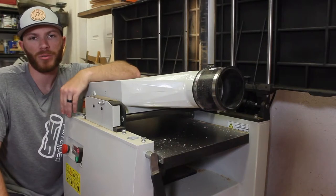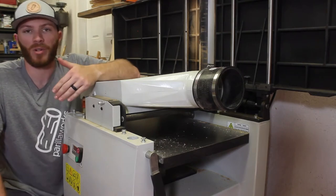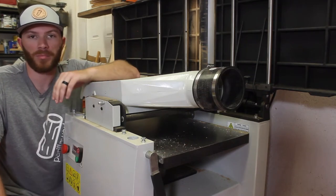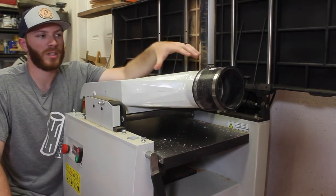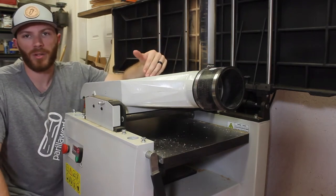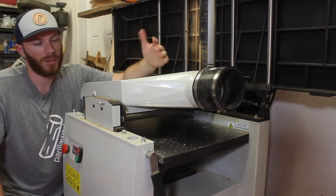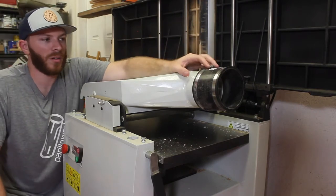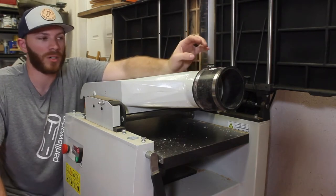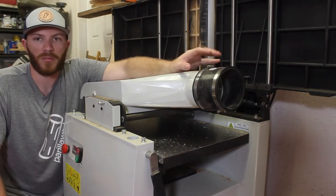This machine is newly redesigned by CWI this year, and one of the new features is a flush electrical panel with only slight protrusions for the on/off buttons and the emergency stop button — typically you see boxes that stick out a few inches and can get in the way. A critical part of most any woodworking tool is how well you can remove dust and chips. CWI recommends a 2-horsepower dust collector, ideally 3 horsepower. I have a 2-horsepower dust collector from Harbor Freight, and in joiner mode I've had no issues — it pretty much collects everything. When taking full width passes in planer mode, I've noticed some chips getting shot out the infeed side, which hasn't affected the finish but is a small annoyance. The port is between four to five inches in metric sizing, and I was able to slip on a four-inch rubber plumbing coupling which solved the issue.